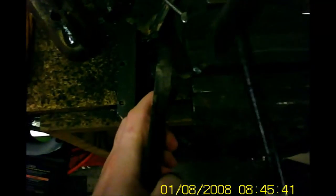Looks pretty good. I have quite a bit to machine off, but that was expected. As far as I can tell, it's welded all the way around to at least the diameter of the part. I might have a little bit of curving on the inside but I'll deal with that when we come to it. Some of this piece will also be machined flat right in that location, so it may not be significant whatsoever.